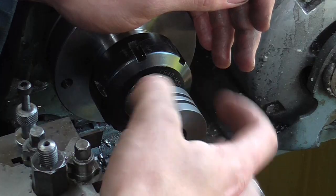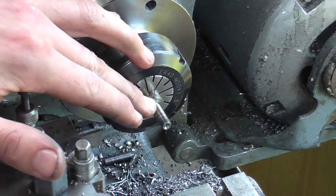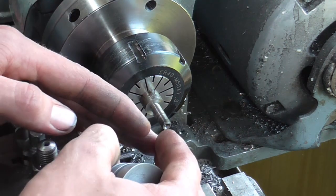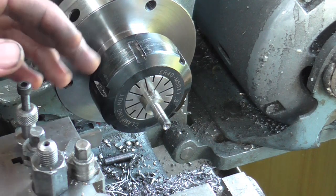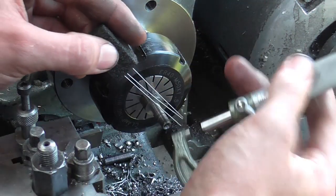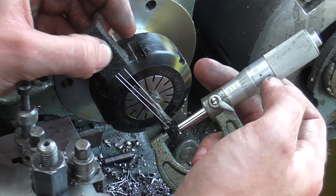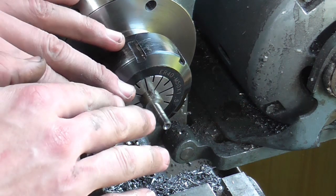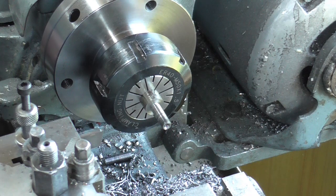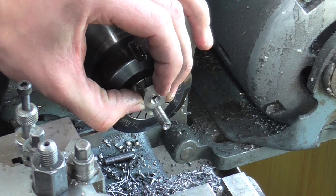This is a simple example of such an opportunity, and I hope to show more complicated setups in future. Ahead of machining the valve rods and piston rods I've been doing some practice — both rods have screw-cut threads, and I wanted to test the machine cutting 40 TPI and also record the dimension over wires so I have something to aim for when cutting the real rods. With this test piece I now have an opportunity to modify it into a little fixture to finish the nuts off — so I'm putting a nut on here and nipping it up.